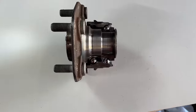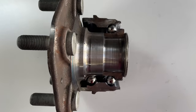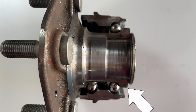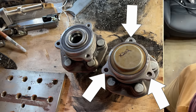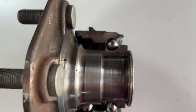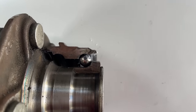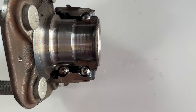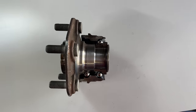It's assembled just how I expected. The only thing that was not how I expected was that the inner bearing race for this bearing is actually just the center steel piece — it's not a separate part like the other one. But I don't see any reason why you would need an axle here. The failure mode would be this whole mushroom flange ripping off. By my quick calculations, that would require at least 30,000 pounds of force, which would probably be more than enough to break the three bolts that hold the hub to the upright. It's probably actually stronger than that — I didn't know the alloy of the steel, but since this part is acting as a bearing race for the outer bearing, it's likely a hardened steel that is stronger than your run-of-the-mill alloy.